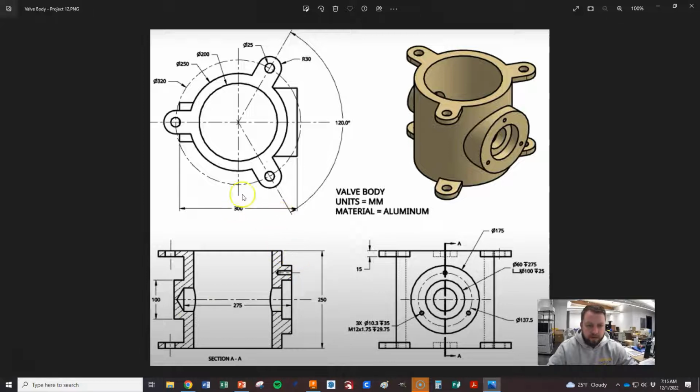I guess this view helps us here to know from this front face to the back end it's centered, right? Because they're not telling us where it's located. And it's a 300 across. And remember that, not that this matters, but from here to here, our outside diameter to this circle is 250. So that means that it's 25 past that. But to start this offset plane that we want to draw this surface on, which is this kind of circle, it's 300, and if we want that half from the origin, it's going to be offset 150 out this way.